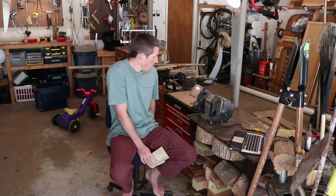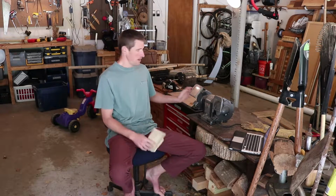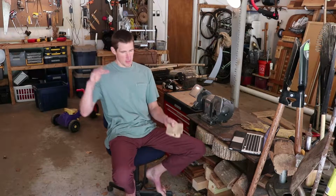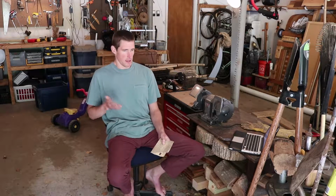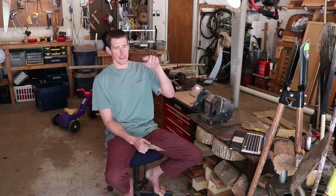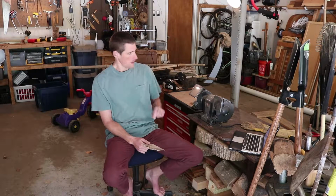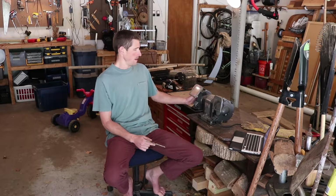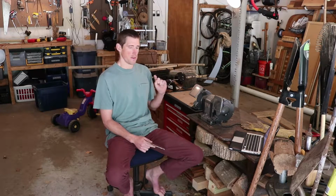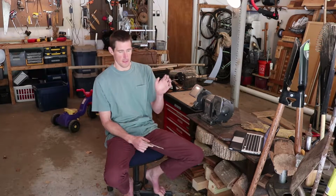that I neglected in the sharpening process here. Whenever you're sharpening anything, like I said in the video, you're generally either going into the blade or pulling out of the blade. Either way, there's going to be what's called a burr, B-U-R-R, if you want to look that up. It's a little sliver of metal that's going to form on the edge. It'll form very readily, especially with a softer metal like a lawnmower blade. And going at such high speed with the grinder, you're going to get a noticeable burr. You can see it and feel it.